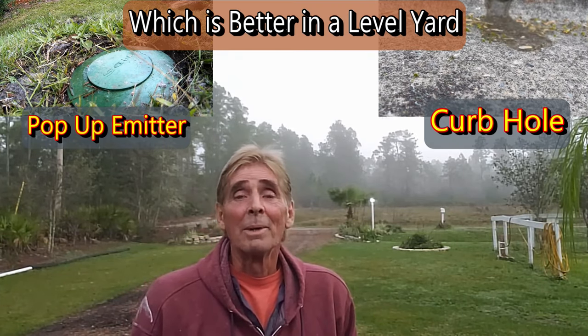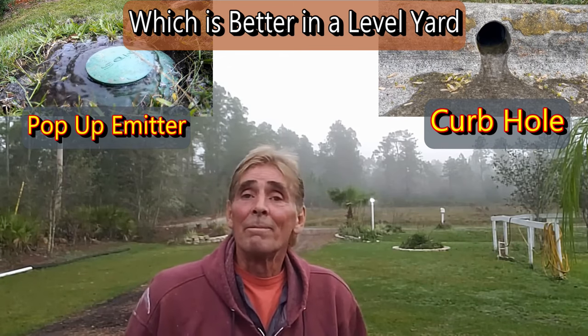Hey, good morning, Chuck here with Apple Drains. I thought I'd post a few videos — there's hundreds of them about cutting curbs, coring the curb, pop-ups versus curbs, drilling the hole, so you can really understand why it's important to drill or cut your curb. You do need a permit, and the reason is because so many small companies and homeowners come out with a big six or nine pound sledge and whack at that curb and break it all up — the city does not like this at all. If you do it right, you'll have no problem. A permit usually runs between $25 and $50.